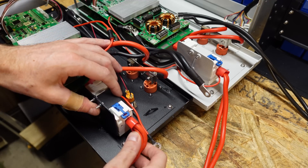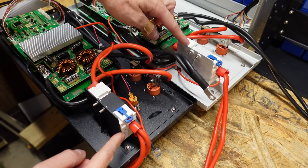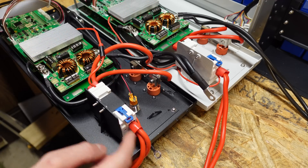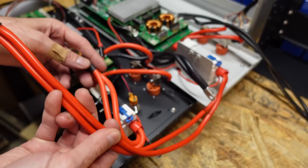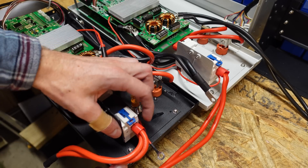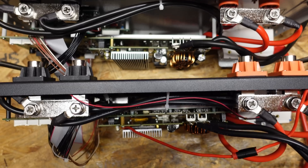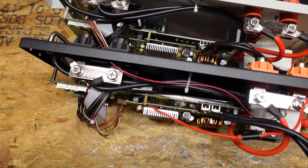The circuit breakers are exactly the same on the back side as well, with identical mounts — one powder-coated, one not. We have the same pair of 7-gauge silicone-insulated wires going into each, with the same termination ferrules on both. Looking down from the top, I don't really see anything else to note as a difference. They are pretty much identical.